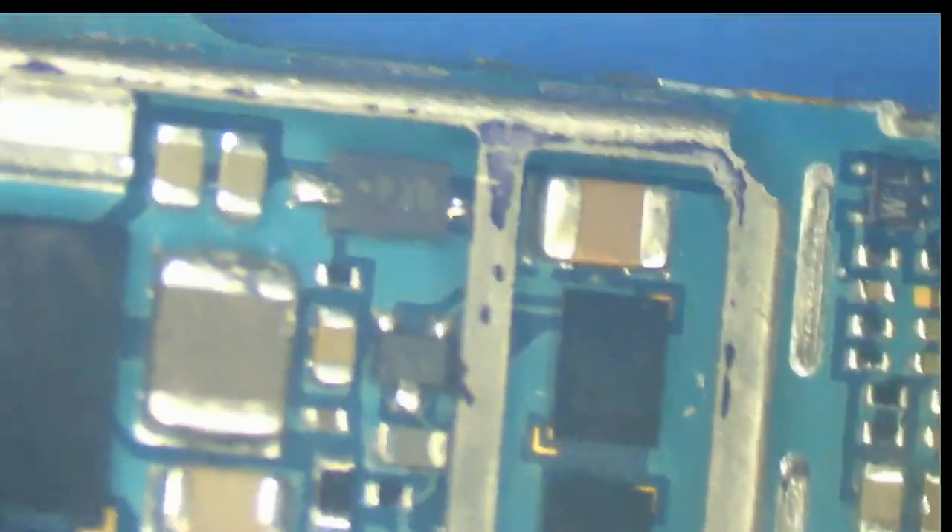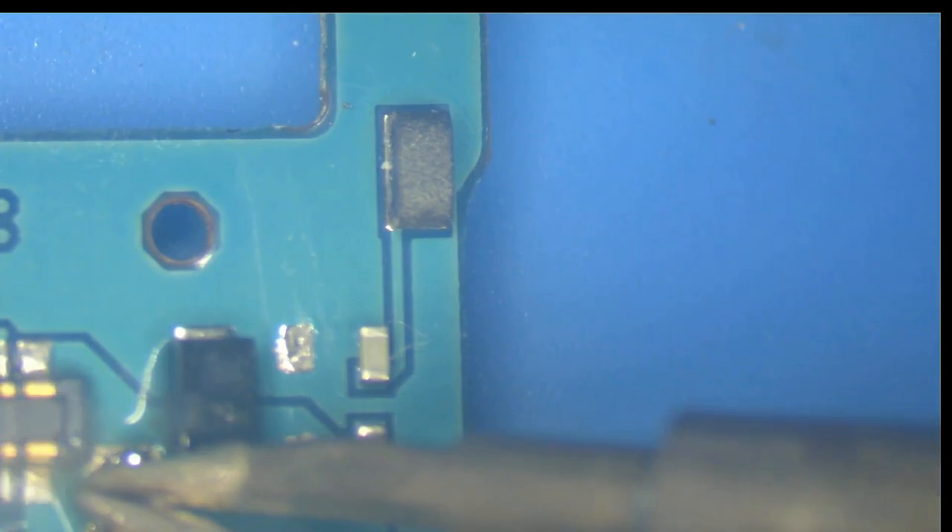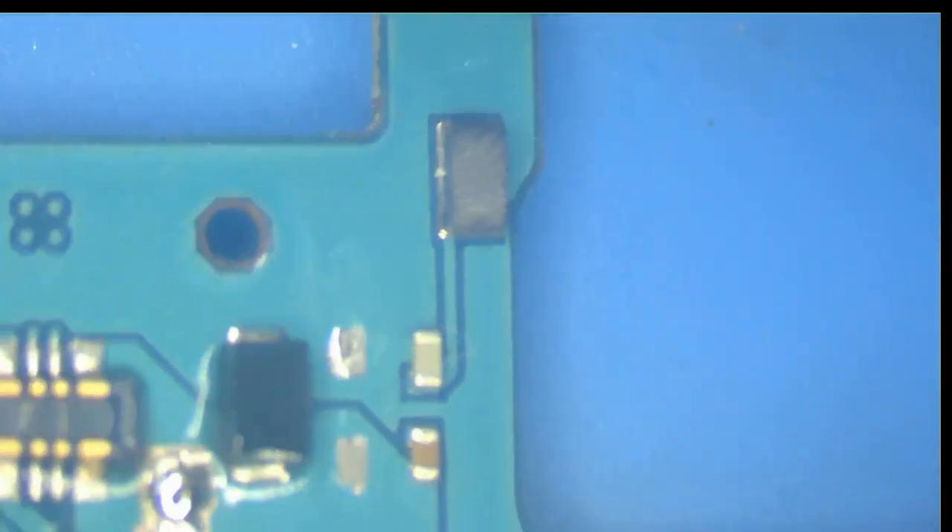I'll move my wire and instead of going in at battery, I'm going to inject current directly into the VBAT line — essentially VCC main — because I believe there's a short from the diode mode reading, and my strategy is to look for heat. I've already looked all over this board and nothing looks physically damaged. It's sudden death, not water damage.